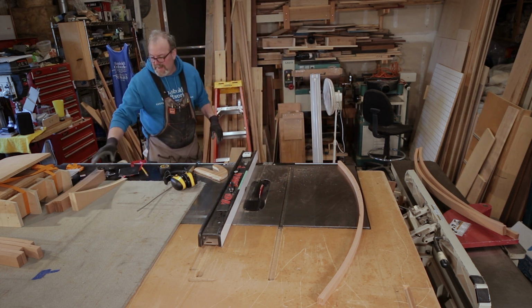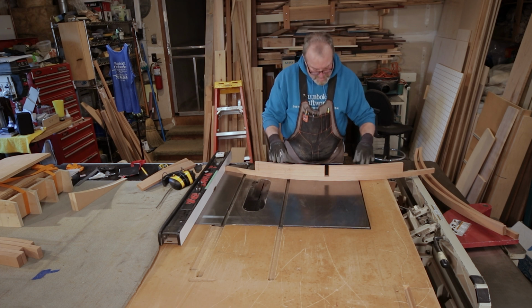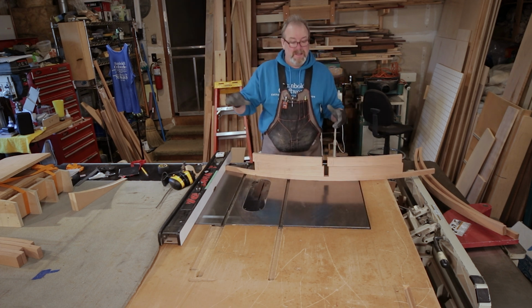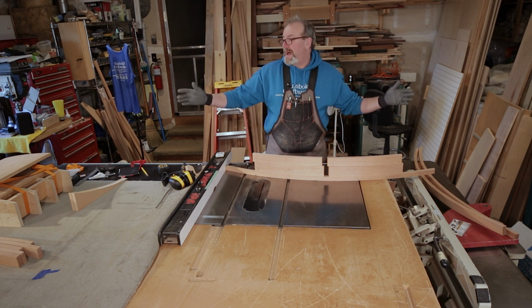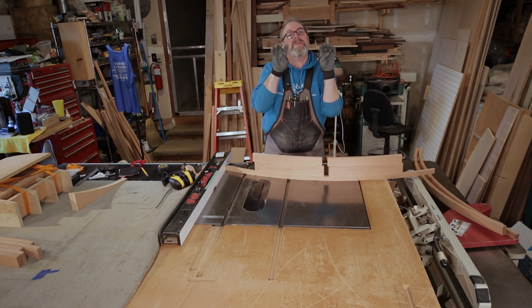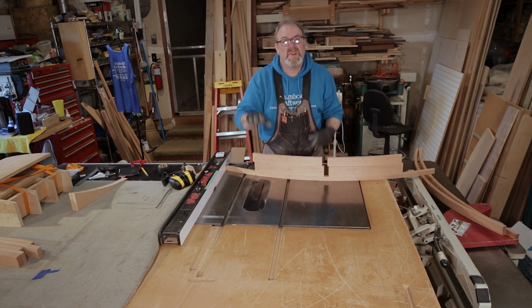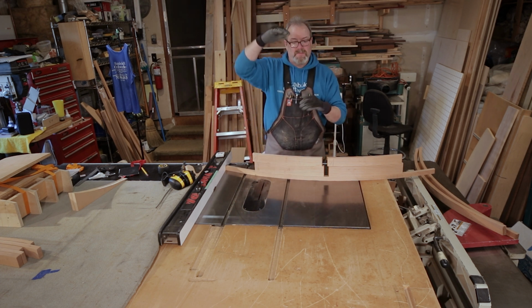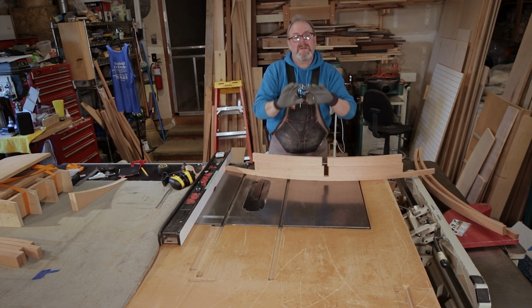That's awesome. Next thing we're going to do is set it up on the template. They're out just a little bit, but what's going to happen is I'm going to make the jig for the bottom that's shaped like a pie, and I'm going to pocket screw it from underneath and screw it into these frames so they're all kind of in there as tight as possible. And once you have that plywood top and bottom to hold everything in the plane that you want, you're good.